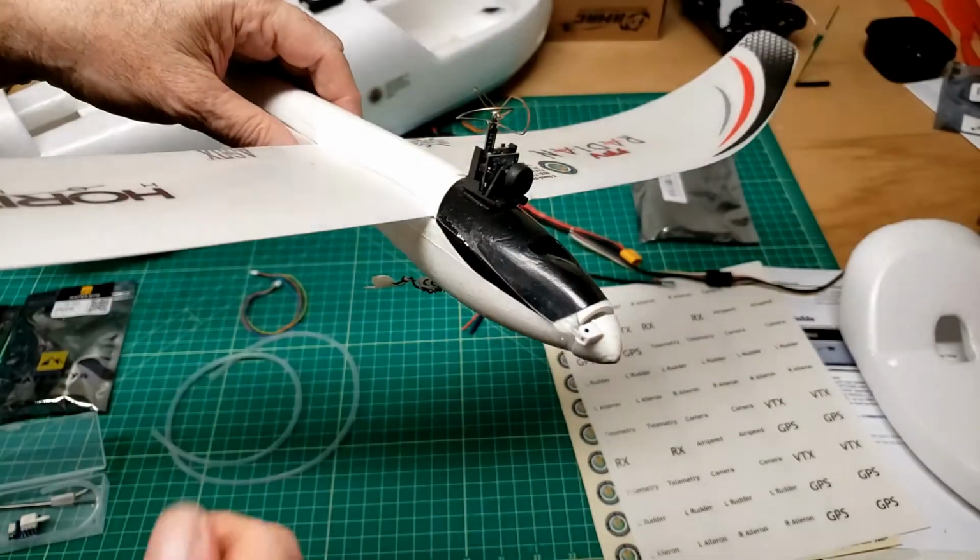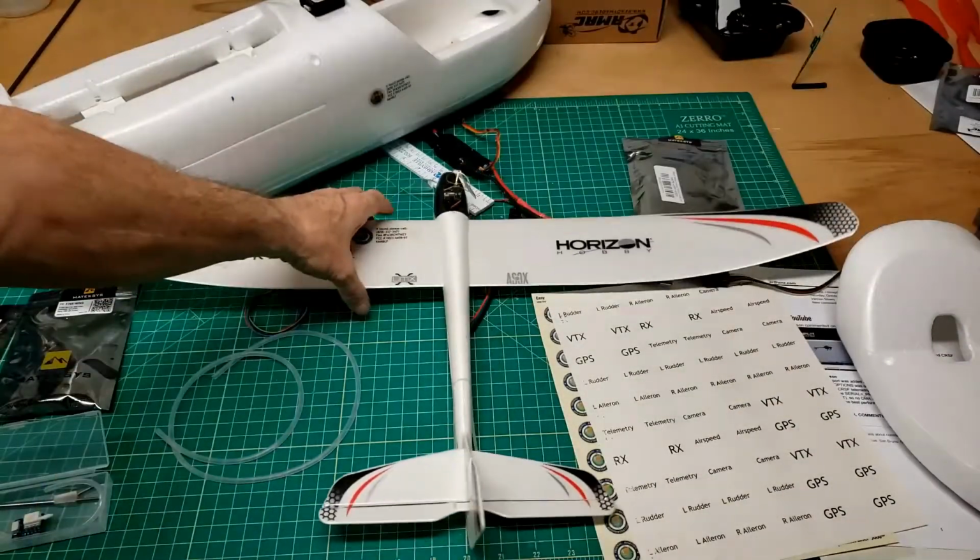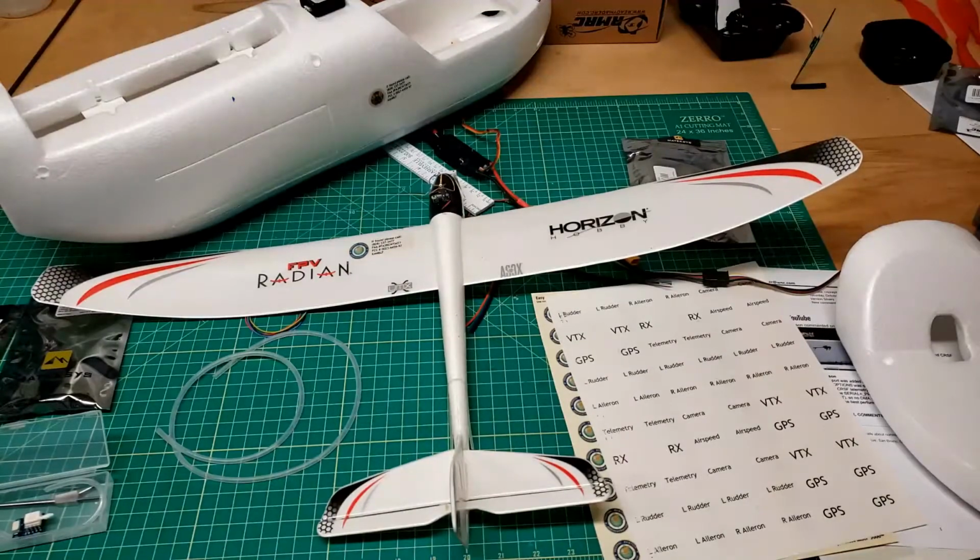Really wish the camera wasn't on it. That's how good it is. It's really bad. I'm sure some of you have had experience with those one-piece cheap deals. But the beauty of this little airplane is the fun of trying to fly it for an hour on a 1S battery. I've never done that. I've flown it for 20 or 30 minutes, and that's probably about 25 minutes of just gliding with the motor completely off, because if you just fly it constantly on the motor, this thing won't fly 5 minutes before it burns the battery down, especially pushing the camera and the video transmitter.